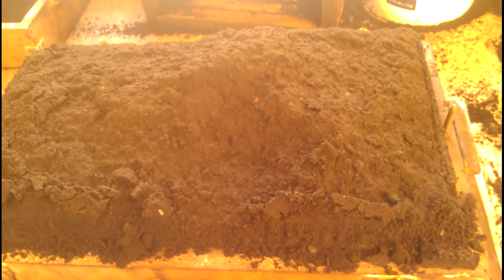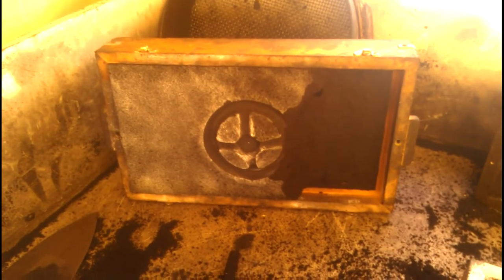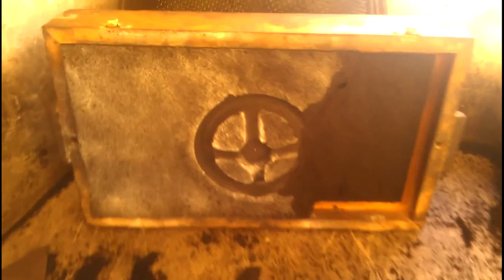Well, can you say jinx — sure enough, I guess I didn't get my sand packed good enough so we're going to have to start over again, at least on this half. We'll cut back here as long as my battery keeps holding out — we may have to pick this up another day. All right, well we got it open this time, but only halfway. Maybe I didn't get quite enough parting dust on here, or it was another bad ram-up. You can see the mold — it actually looks like the hand wheel part is parting out really nice.